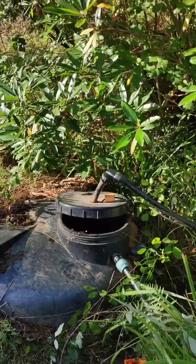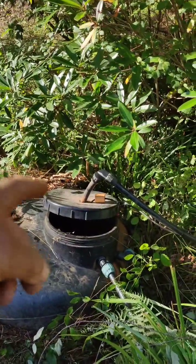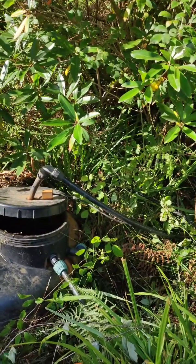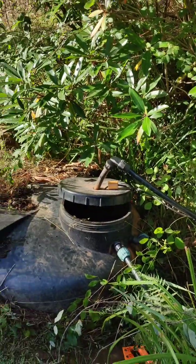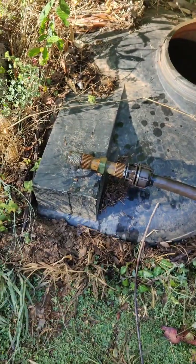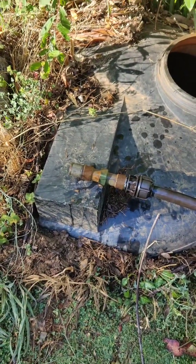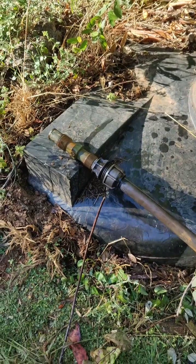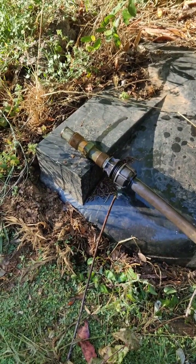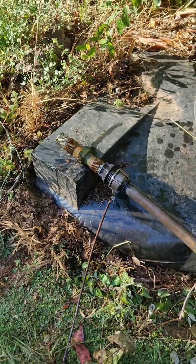First thing we've got to do is take that joint apart there and let the pressure out, because there's water from there right the way to the top of the tank. So this is the one-way valve. I'm going to take that off, and there's going to be a lot of pressure, but I can't film while I'm doing it. As you can see, I've loosened it off and there's about 5 bar of pressure there. So in a minute when it comes off, it's going to go poof, so I'm going to get wet.